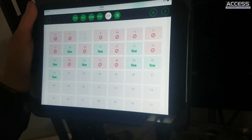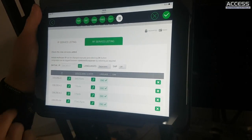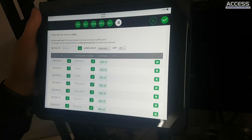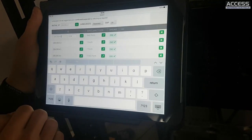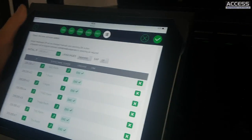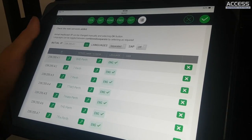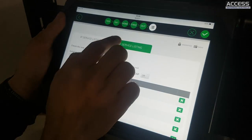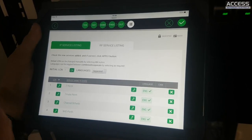Once you've selected all the channels, go to the last step. For IP you can configure the initial IP of all the IP multicast services, or configure individual IPs and ports for each service. The default port is 1234 but you can change it, and you can change all the channel names. You can also use the SAP protocol if desired. For RF, LCN configuration is provided - by default Australia uses LCNs so we give it by default.